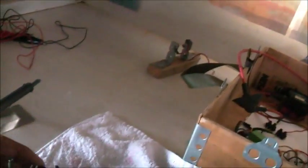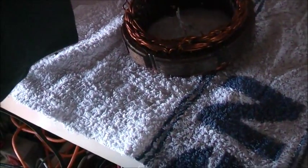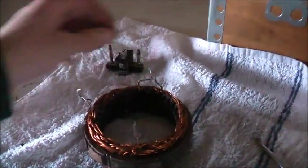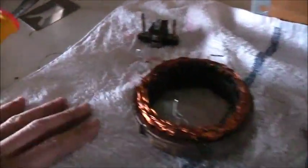That will all be separately bolted away — that will be my exciter, so that one and that one. That one here just goes to earth, won't be using that one. I think you've got to tie those together — that's one side of the coil, and the other side of the coil for one pole. So tie those together and wire those up, get the rest of it out and all cleaned up before I even put it back together, because it is filthy.